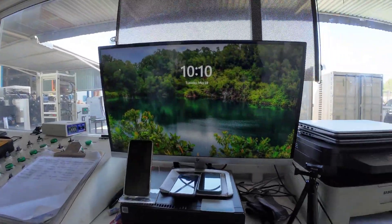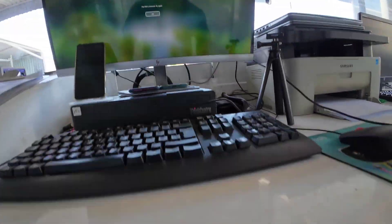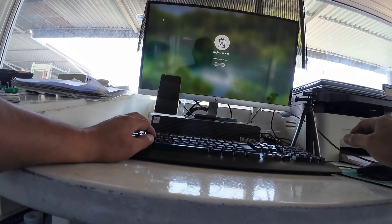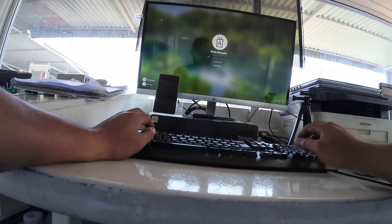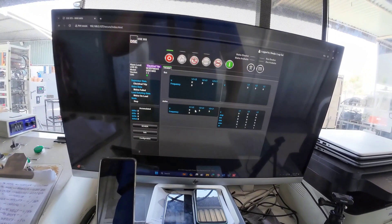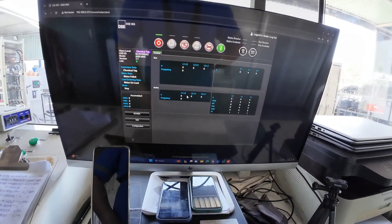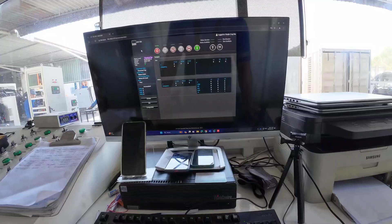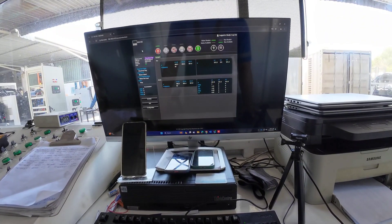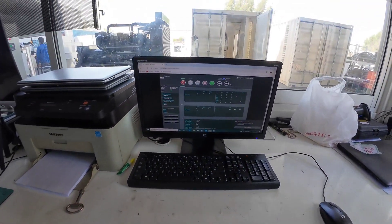Now let's try to power up our mains. Let's go to the other computer so I can check if we are correct. This is our mains control. I will try to open the breaker and double check if we can sync to our mains. Start the synchronizing for our mains — it is already there. I will start the generator so we can manually sync to our mains.